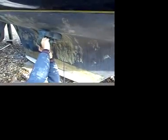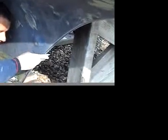Making sure we take the usual precautions against dust with dust masks and goggles, we can give the hull a final going over with a 60 to 80 grit to get rid of the last of the shine and any ridges. Remember too the places where the sander can't reach, such as the leading and trailing edges of the keel or rudder. Now, after sanding the gel coat, it's important that all the sanding debris is removed, and this needs to be washed down thoroughly with fresh water.